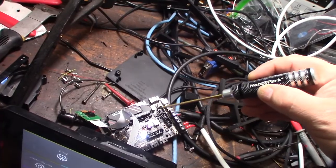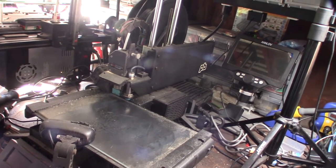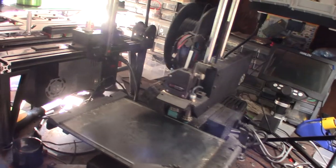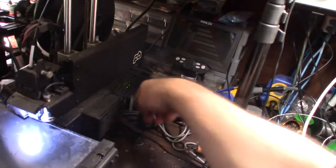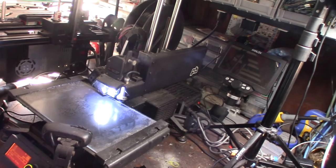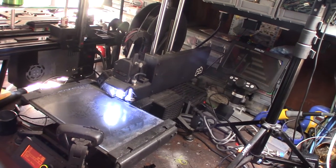All right, I'm at the point of no return - I'm going to tear this thing down. It's worked flawlessly for years. Even the original bearings are still in there, though I did upgrade to a BMG-type extruder. Because it's so small, the print quality is incredible. I need to heat it up and pull the filament out, then I'll work on the power supply design. The original didn't have a heated bed - back in the day heated beds weren't really common. We used blue masking tape to get things to stick. The fans are going out so it's a good time to fix everything.